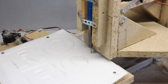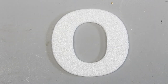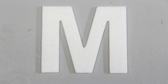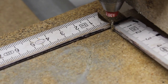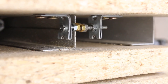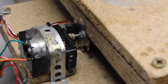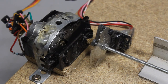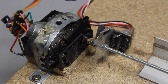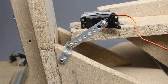Depron is cheaply available and is a proper material to demonstrate how a CNC machine works. The machine is meant to be an educational tool for learning computer numerical control, not a production tool. You have to go to the starting point manually, and there are no switches detecting the end points of movement. Many software parameters can be adjusted, so many things might go wrong. If you enjoy trying new things and are willing to spend a weekend, you can get a working CNC machine for just some bucks — and you'll get the knowledge for free. Build instructions for this and even more powerful CNC machines can be found on the project page.